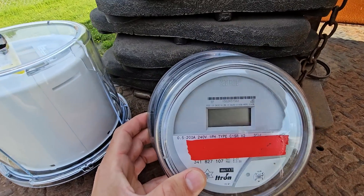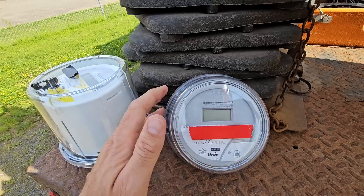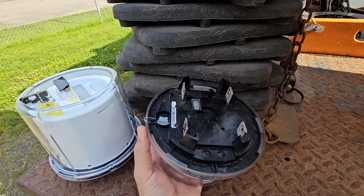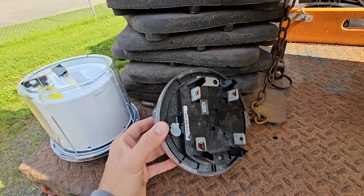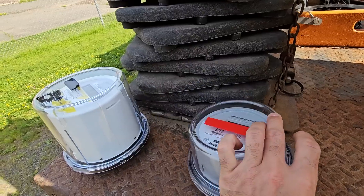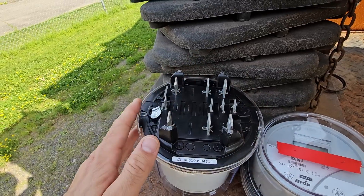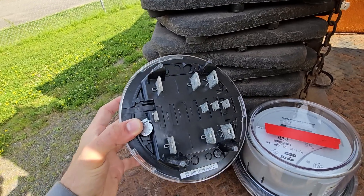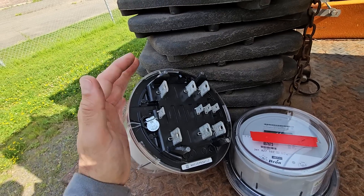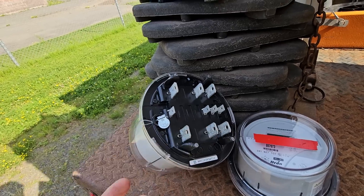On the meter itself you can see it's rated for 240 volts and up to 200 amps — that's very important. There are many different types of meters, including transformer-rated meters, where the voltage and current must be transformed before passing through the meter because the values are too high and would damage the equipment. This meter here is not only transformer-rated but also designed for three-phase — that's why there are more lugs. There are also self-contained three-phase meters where voltage and current pass straight through, for customers under 200 amps.